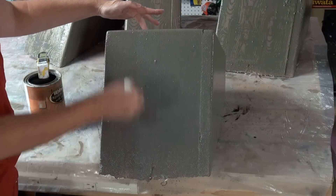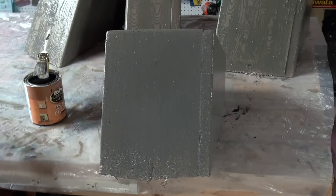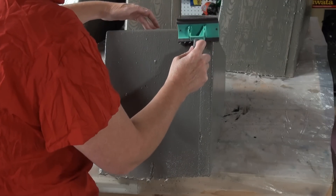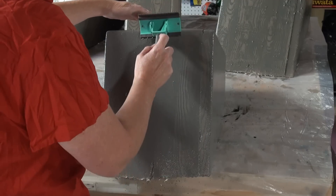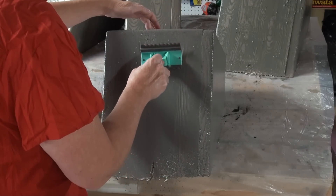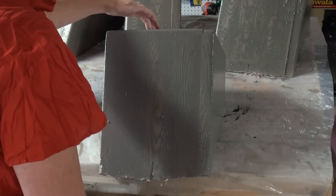Make another glaze, even darker — quite a lot darker. Put on another nice even coat. Now you're going to use the wood graining tool. In a nice slow rocking back and forth motion, you leave behind these wood grains. Change it up — you don't want it to look the same, so it'll go really far with the brush or really subtle.